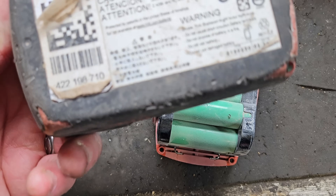Why does this imbalance happen? It happens over time. None of the boards in these batteries actually balance the banks of cells — regardless of what the companies will tell you, none of them do. These cells fall out of balance over time and fall below. The cells sitting at 4 volts signal the charger that the battery pack can't take any more charge. If any single bank of cells reaches the top voltage, the charger stops as a safety precaution — you don't want to overcharge any cells. Similarly, the low voltage shuts off the tool, and the high voltage shuts off the charger — it works both ways.